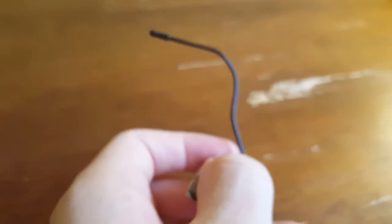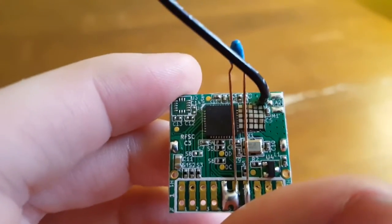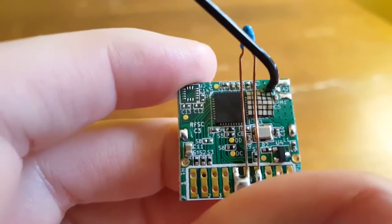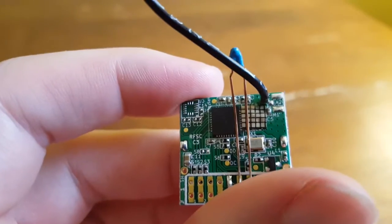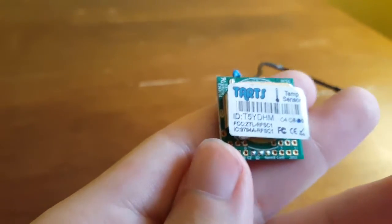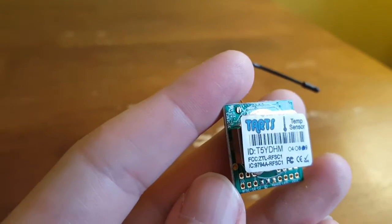We can see the leads: one is soldered on and two are bridged across different connectors, so there's probably some kind of pull-down happening there. Then we've got this nice long antenna that allows transmission at the 900 MHz frequency. There's a little microprocessor of some kind on there, along with resistor and capacitor networks to run all the components. One thing I'm not sure about is this mesh component on the side labeled X1 on the board — probably something to do with the antenna. And on the back we have the sensor ID, which is how you identify it in their software to see values coming in from your Arduino or Raspberry Pi.